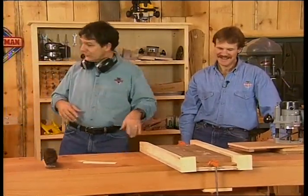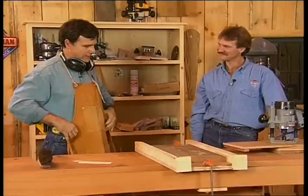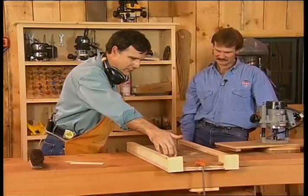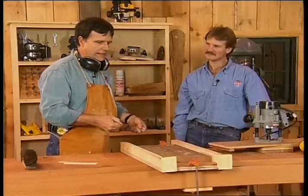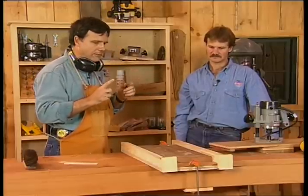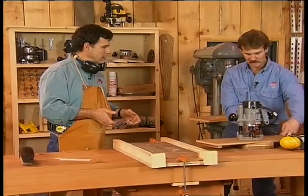I'm going to do this differently to try to avoid some problems. I'm going to put on this apron so I don't get sprayed with the black walnut dust, which is a terrific dye. You may have noticed that as you try to guide the router bit by hand, it would often skip and leave little raised areas you had to come back and get. Part of that is the difficulty of controlling the bit as it cycles — it can't decide which cutting facet will predominate, so it jerks a little. So I want to clamp on a fence and make passes in orderly, established rows.